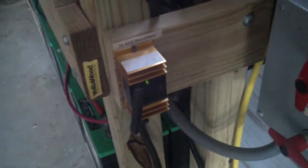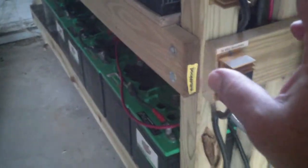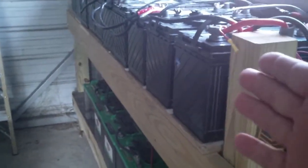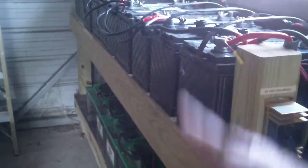I ordered a forklift-type battery desulfator to put in place, which is perfect for something with such a large capacity. I have over 5,500 reserve amp capacity between these two banks, so the current desulfator is a little too weak. But as you can see, the specific gravity on my batteries is just perfect now.